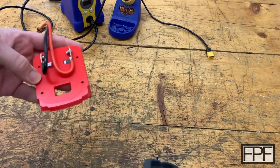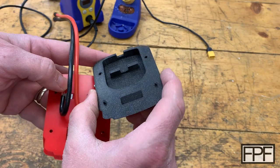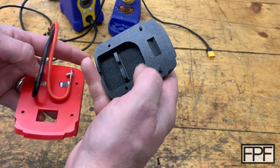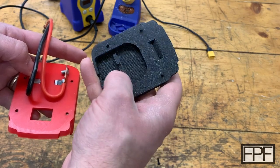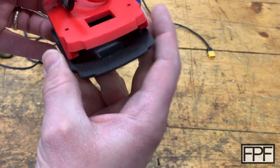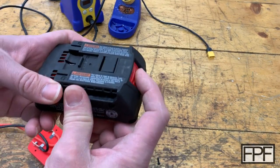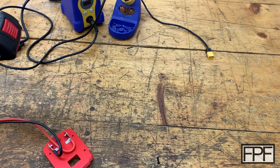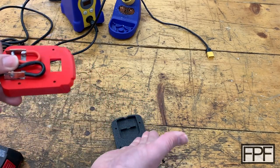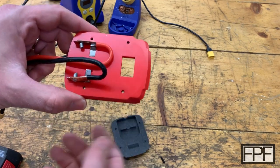You can see there are two little spacers — one of which has fallen out, one of which is still here. The purpose of those spacers is to be held down on the stainless steel terminals by these little fingers here. I did them as separate spacers so that I could print this guy flat on the bed without those fingers projecting up and causing me to need to print this entire thing on a raft or support. Let's go take a look at the design in SketchUp.